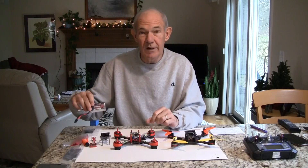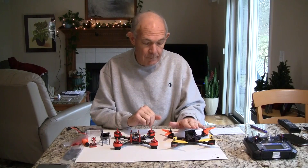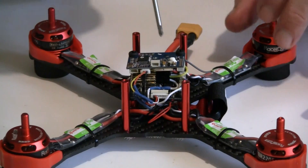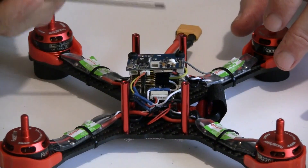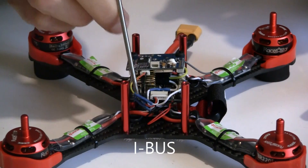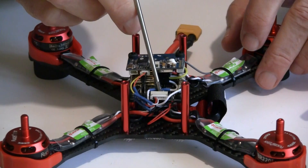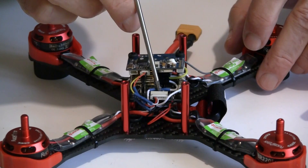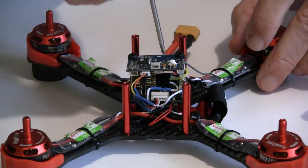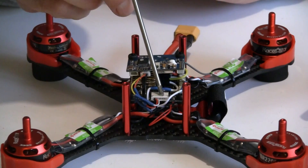I also have a 4S battery — it'll fly 4S, though it's not quite as fast as my earlier one. Taking a closer look: on top you have the FlySky receiver, it's about a half-board size and bolts into your stack. I'm running S-Bus off of it, and I had to splice a cable together to make it work — it plugs right into the SP Racing F3 flight control board. The actual control board that came with it was faulty; it would run for about 10 seconds and then turn off.